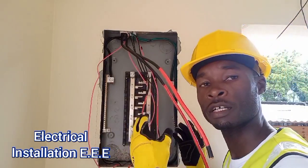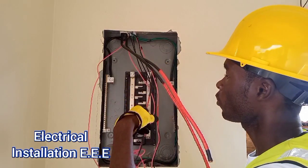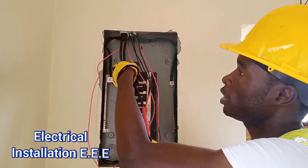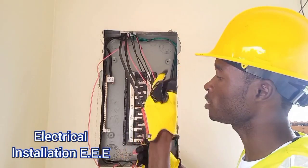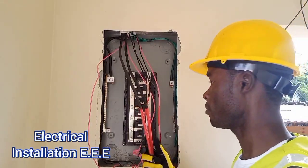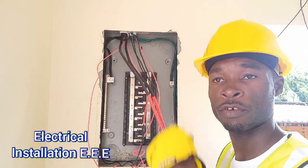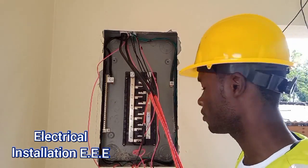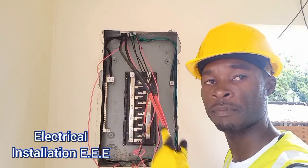We don't want current traveling both ways. So when we do it in the sub-panel, we separate it — because if anything occurs in this panel, especially if the main breaker feeding this panel is connected on a breaker in the main panel, we don't want two paths carrying current back to the transformer. We actually want one way. That's why we do it this way. We separate it in the sub-panel; it's already linked in the main panel.